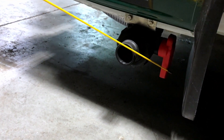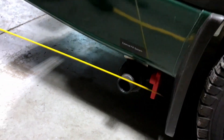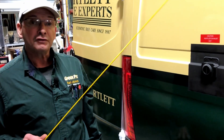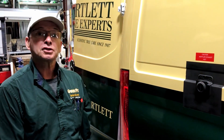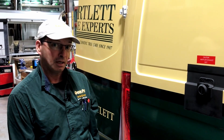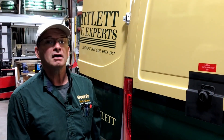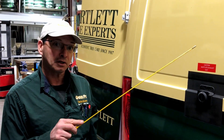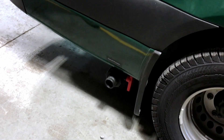It has a red handle to be shut off. Now on this particular unit with an open air gap, you have one valve right here. When you're using this system, there's usually another valve on the inside that closes the fill system off from the manifold. Now if you don't shut that valve, it would suck air through the fill system if you don't shut that internal valve that goes to your suction manifold. Remember, the open air gap system only fills the 300 gallon tank. The brass system fills into the suction of the manifold and then it is distributed from there. So we have to make sure that valve is closed on the inside behind the manifold.